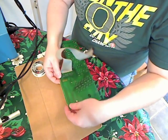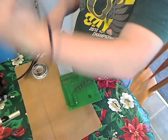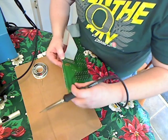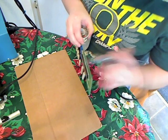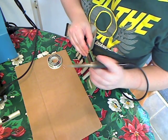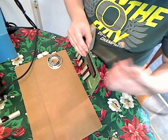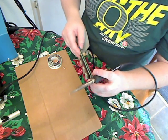I'm going to go ahead and solder the pins on the right side. While holding the display in place, I'm going to tack one pin first so I can keep it from moving, and then I'll tack the rest of the pins after that.